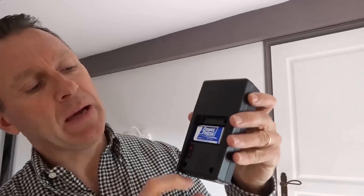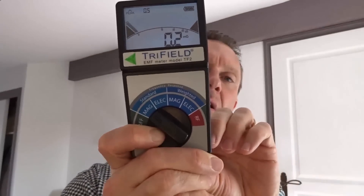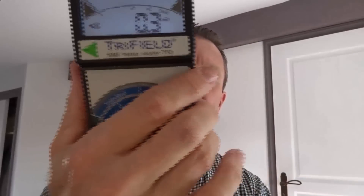The first key thing to know about the Trifield TF2 is it has really good magnetic field functionality for the money, typical of Trifield meters. Second, it does have a backlight and an audio function, accessible by removing the back cover — there are two small red buttons inside, the top for the light (three settings) and the bottom for the sound function, which sounds a bit like a Geiger counter and lets you monitor readings without watching the display. Third, it has vastly improved radio frequency mode sensitivity compared to the previous version.